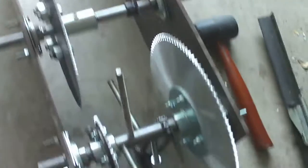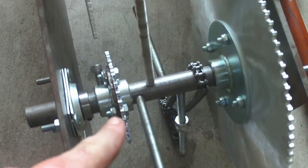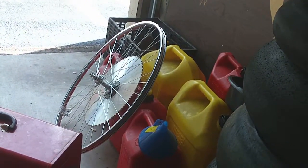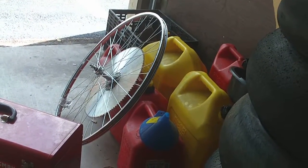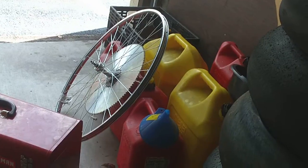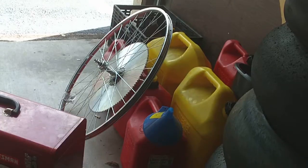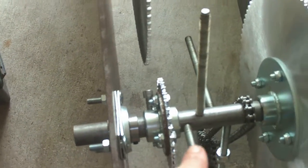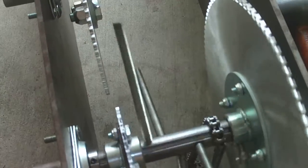Right now we're just trying to get things lined up to the point where I know where the set screw holes are going to be for drilling and tapping. Some of you are probably asking: what the heck are those long things sticking out in the middle of that jack shaft or axle? We'll get to that in a minute. First axle — we're going to drive from a big wheel. We're actually going to go with about a four or five foot wheel; that's just a temporary one we'll use to test with. It's got a little aluminum sprocket on it. We'll eventually go with about a four or five foot diameter wheel for better torque. It's going to drive this little sprocket on the left — 34 teeth. We've got four threaded rods sticking out of there. What's that all about? We'll get to that in a minute.